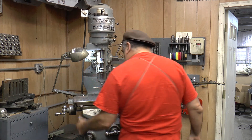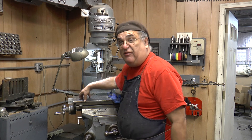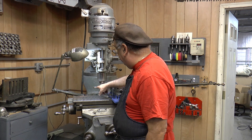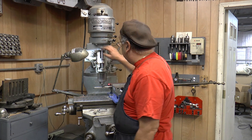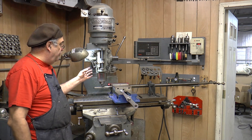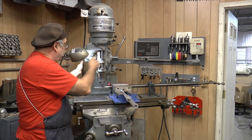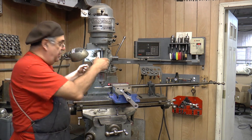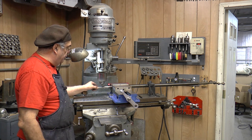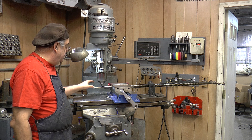Another thing I needed to deal with was the table not having enough travel — it's only a 32-inch table, and that's one nice part about going over to the 42. I was almost to the end of the travel. So with the vertical turret mill — which is the proper name for this machine — the whole dovetail ram that the head sits on can swivel back and forth anywhere you want. I loosened up the four bolts, swung the head way over here, and I'm able to work on this side. It's not going to lose the indication — and even if it did I can re-indicate — so now I'm pretty much ready to cut the keyway.